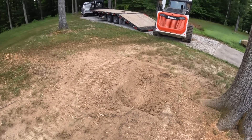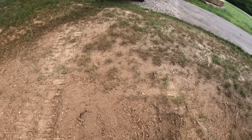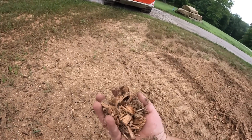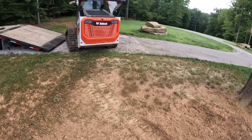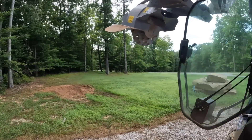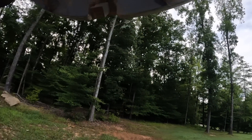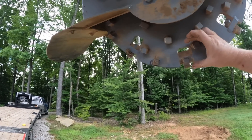Alright, that was about 10 to 11 minutes in real time. You guys can see I'm a good ways down in the ground there — that's pretty quick. I didn't want to get too close to this hickory tree, so that was a hard stump. You can see it's all covered in dust, but the thing's throwing off some good chips for sure. A guy can use that right back to grow grass in it. We've got one more stump over here we're going to grind. I'll set you guys up inside the cab. We've got a maple tree here — it was actually hollow in the center, about a 28-29 inch stump. I only use about an eighth or a quarter of the wheel at a time, grinding two or three inches — it trucks right along really quick.